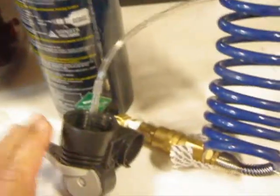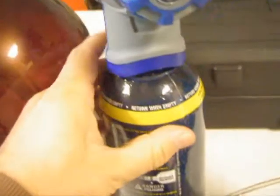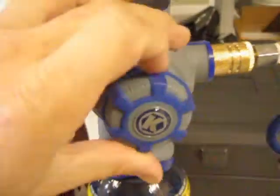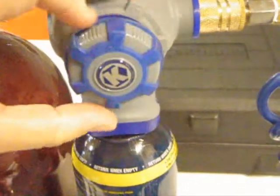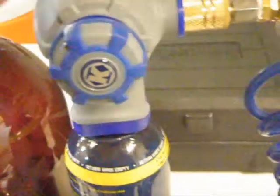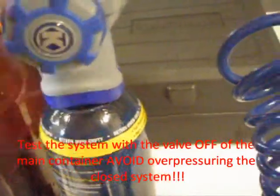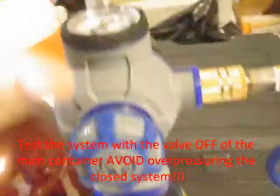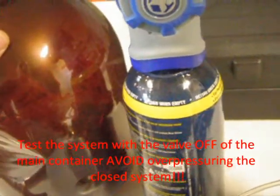I've made my quick connect fitting to both sides of the regulator. Before I lock down the bottle, you want to make sure that you've turned your regulator valve as far to the left — counter-clockwise — to make sure it's actually in the off position. As you rotate right, you'll start to increase the pressure. Certainly if you over-pressurize it, the container will explode — it'll find the weakest point and crack it — so you want to start off slow.